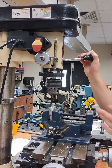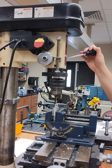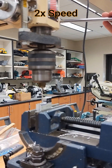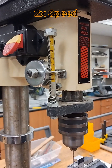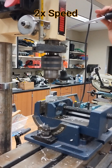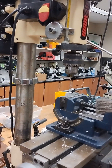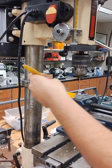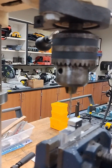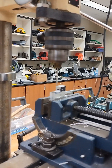I'm going to have to do a couple of pecks at this because it's a pretty long hole. We'll turn it on, and just like last time we do nice, even pressure. That's about a quarter of an inch deep — I'm going to come back up and turn this off for a second to clear the chips out of the flute. If you see chips stuck in your flutes, that's going to prevent you from clearing out additional chips, so make sure this stays clean. If you see it get fouled up, take a second, clean it out, and then you can continue.